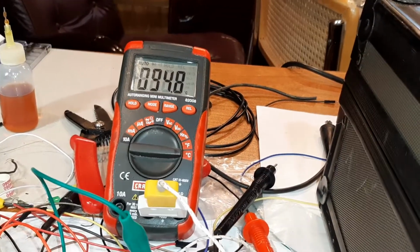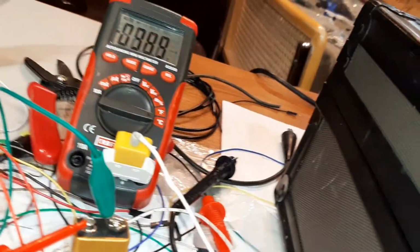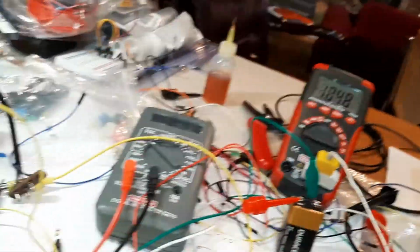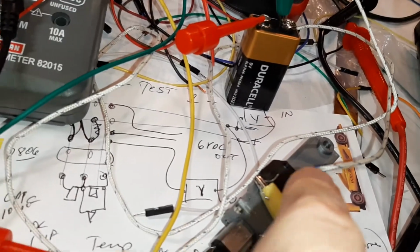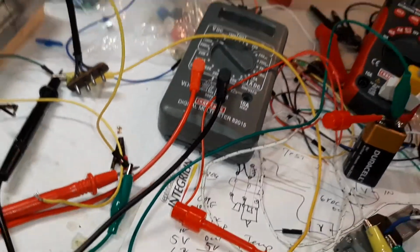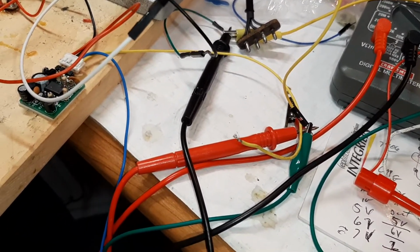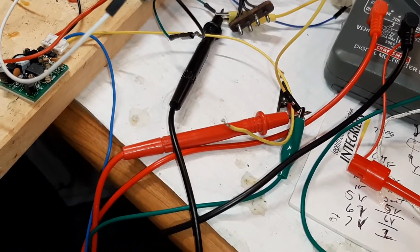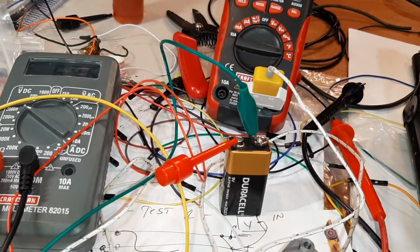I think it was like 115, I'm not sure. Okay, I'll do some more tests, and I might come up with another configuration and set that up. But as you can see, with a 12 ohm resistor for the heat, you're going to get 110, and all you need is 7 volts. So how are we going to get this 15 volts to behave? You know, when it starts at 8, that sounds reasonable, 8 to 8, but drops to 7. You really want something like 6.5. I'm going to have to work on that.